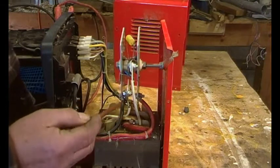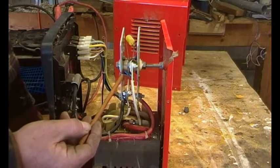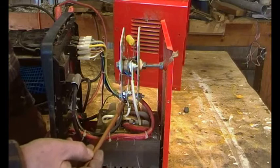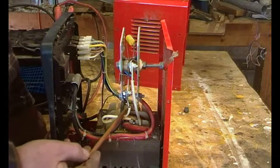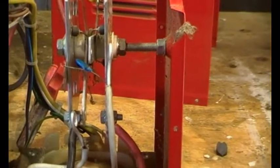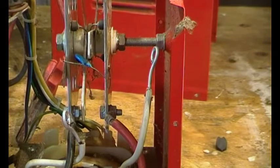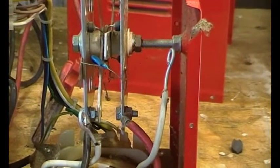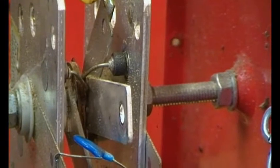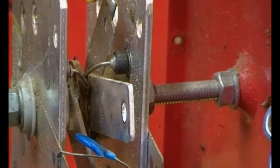Because we've got high voltage out and low current, we need to look at the rectifier. To test the rectifier we need to remove the two AC inputs and disconnect any DC from batteries so there's no circuit on that side. So now there are no connections to the rectifier at all and we can test the diodes. I've looked at them all and there's nothing visibly burnt, so we're going to use the multimeter set on continuity to see what happens.